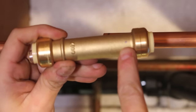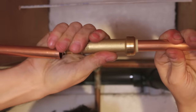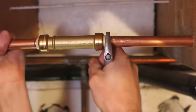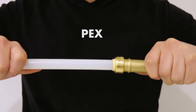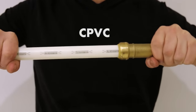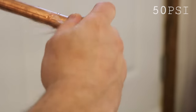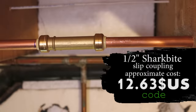After, identify the slip end of the fitting and insert it onto the pipe until it clears the other end, then use an adjustable wrench to push it in until both marks are visible. And the repair is done. SharkBite fittings also work on PEX and CPVC and don't require any glue or soldering skills. They could also be installed on a leaking pipe just like a compression fitting. This method is code approved if installed correctly.